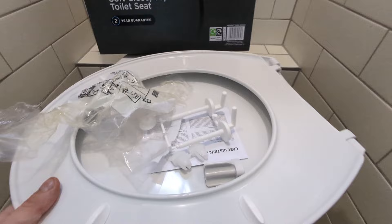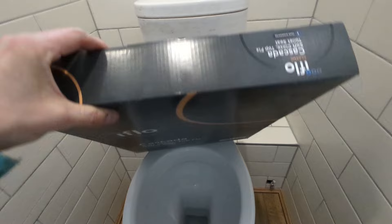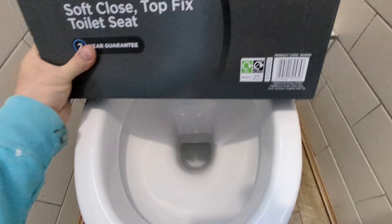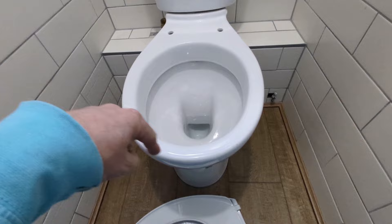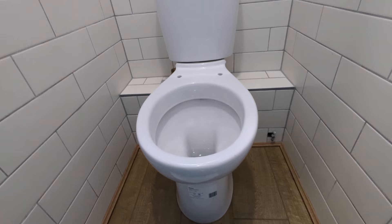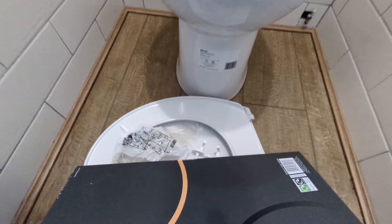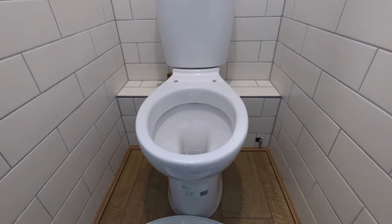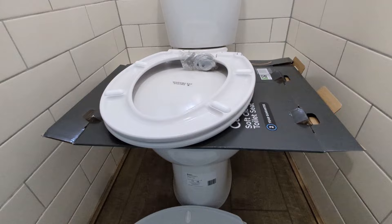So that cheap seat is going in the bin. I'm going to show you very quickly and easily how to install one of these toilet seats onto a close coupled toilet. The first thing you want to do is make sure the front of your pan — this one is rounded — so be aware of your dimensions and make sure you buy a rounded toilet seat for a rounded pan. My own toilet at home is squared so I have a square toilet seat. I'll put a link in the description for a cheap standard soft close toilet seat from Amazon which is pretty damn good, very robust, and certainly far better than this cheap rubbish. I'm going to open up the box and get installing — I think once you've seen this video you'll wonder why you put off changing your toilet seat for so long.